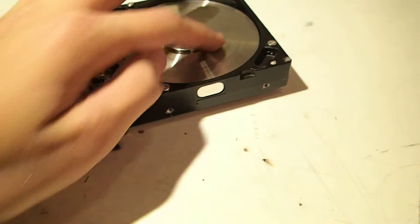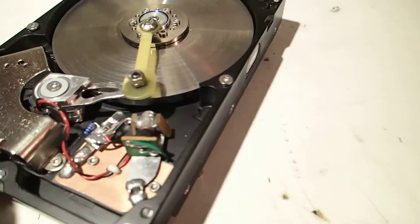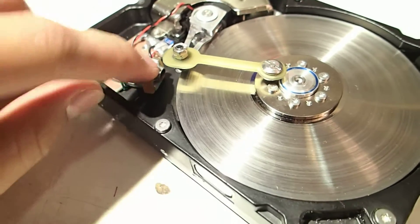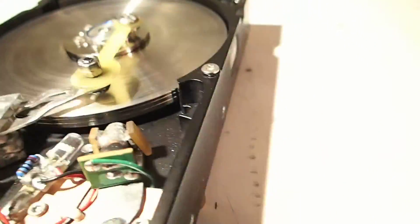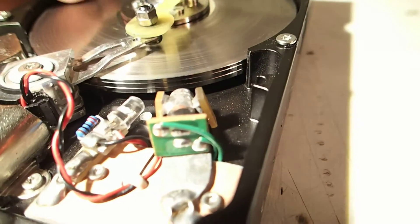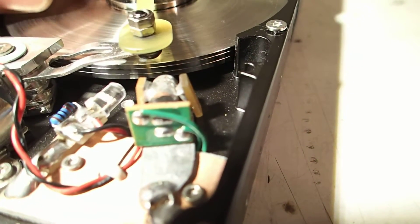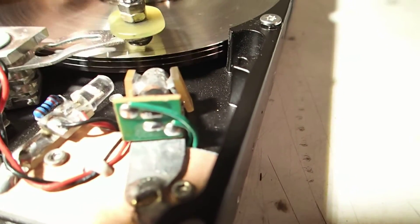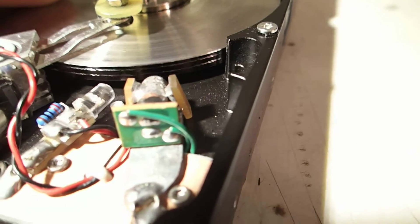Most of them just use some pin that touches the disc, with some tape isolating it like a mechanical switch. This one uses an optical sensor right there. It's a light-dependent resistor in there, with a little tube to protect it from ambient light, and a little red LED right here. So it shines at the disc. Some of the disc is colored with black Sharpie marker, and where it's colored is when the coil turns on. It's pretty easy to adjust — you just color or remove a little bit of marker off the disc.